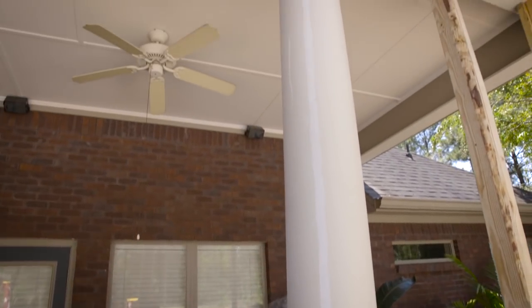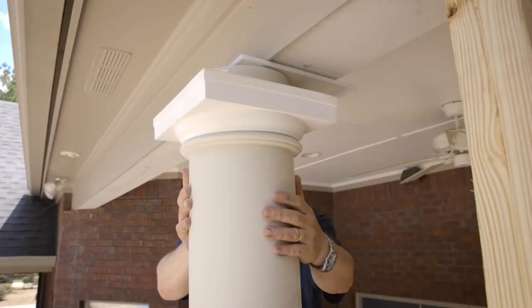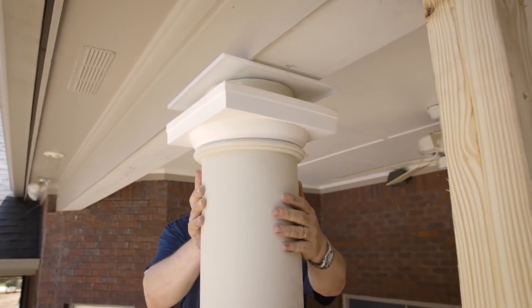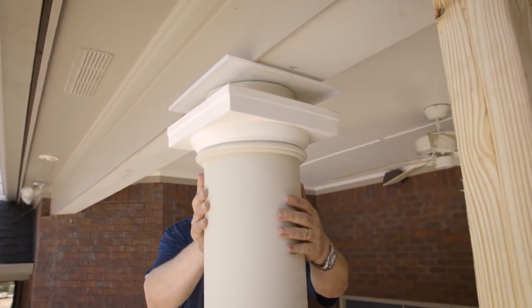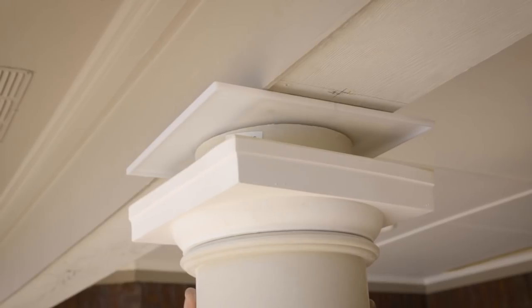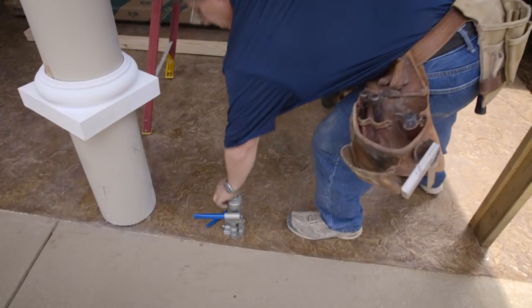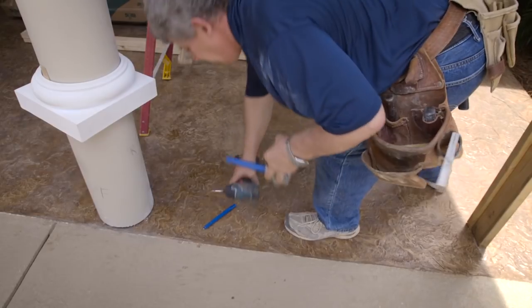Line the column up with the flashing cap underneath the beam. Make sure to keep the front, left, back and right positions in the proper place. Slide the bottom of the column shaft into place so the bottom edge of the column is aligned with the column shaft tracing on the floor. Ensure the cap is centered and release the jack so the beam now bears on the column. Remove the jack and double 2x4s and set them aside.